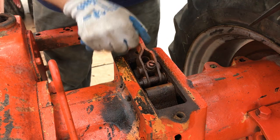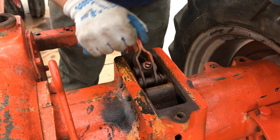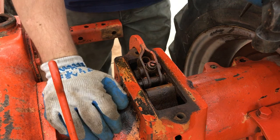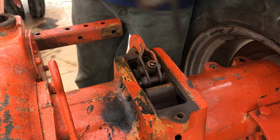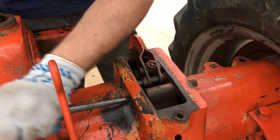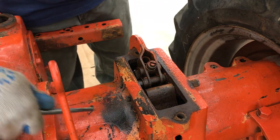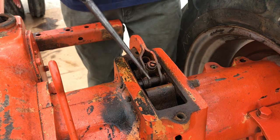See what's happening there? This bracket is stuck to the pin, so I've got to come up with a way to get this bracket off without busting the pin — this is going to be tricky. Maybe put a spacer right here and keep drifting it out. Once you get it so far, you really can't get it any farther with the drift because of the angle — you're not aiming for the pin anymore. But now I can pull this band back, grab onto this, and pull it out.